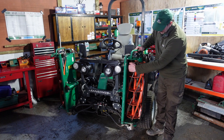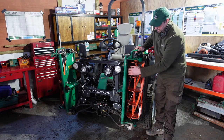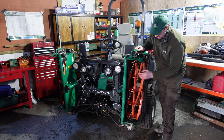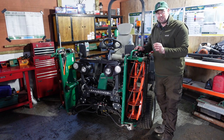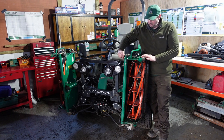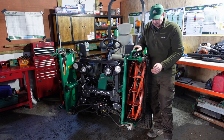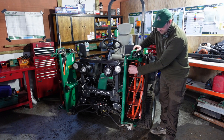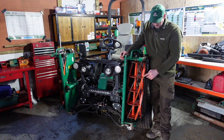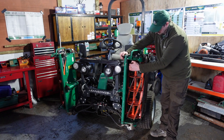Next, the cylinder. As I said, we use six knives. You spin it round by hand — they call it the 'Ransomes whisper'. As you spin the cylinder round it should just be glancing off this bottom blade, and that allows it to cut the grass efficiently. To adjust the cylinder, we use this knob on the top — clockwise pushes it down, anti-clockwise releases the pressure and the cylinder moves back up. If you push it too far down you'll hear a clonking and scraping — that's not good for the cylinder or the bottom blade, so we back that off to a sensible level.